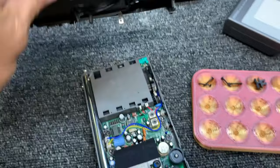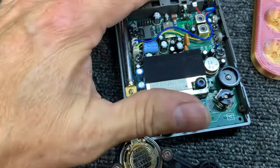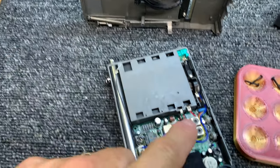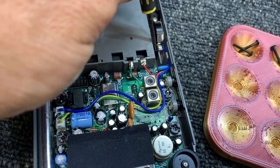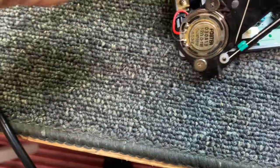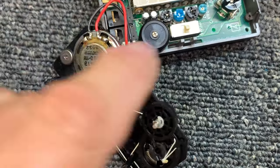I have the case open - just four screws come out of the back, then you unplug the LCD. The rest of the unit has the battery compartment as you can see. The screen is spring loaded and really fast spring loaded, so they put in a geared dampener system right here that allows the screen to just open slowly. This is a very stiff dampener that allows the screen to open smoothly and slowly.